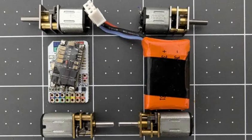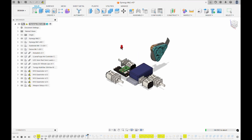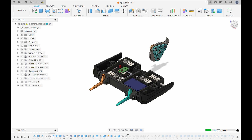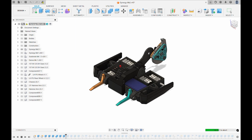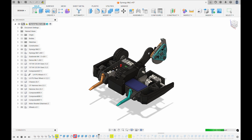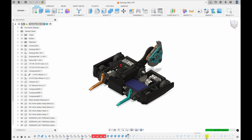One area for improvement over Mark II was packing the electronics tighter — the more volume I need to armour around, the more weight is wasted. After settling on a layout, I put the components into Fusion, laid them out accordingly, and modeled the barest chassis possible to hold the electronics. From there, adding armour and fork mount points, and separately modeling cast polyurethane wheels and weapon systems, got me most of the way to a finished product. Using the properties function to estimate the weight of machined components and printing the chassis put me on track for having 24 grams left for forks, bolts, top plates, and wheels.